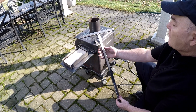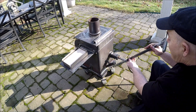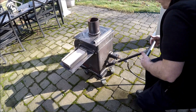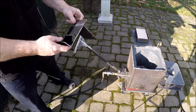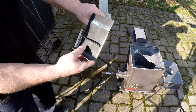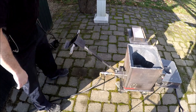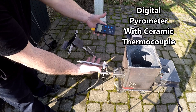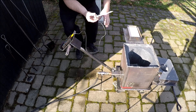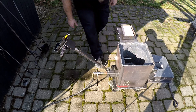The other thing I needed was this handle, made out of three-quarter inch square stock. It slips into a one-inch square tubing, and that's terrific for moving things around. Then once I built that, I put this little bracket together that you can mount to the handle with a few magnets, and that's going to hold my pyrometer. That way it's an easy setup — I can just quickly look at it and monitor the inside temperature.